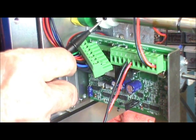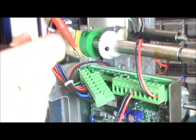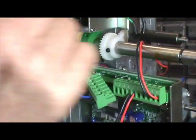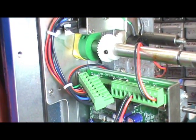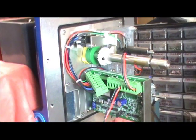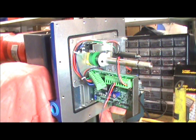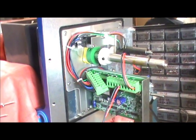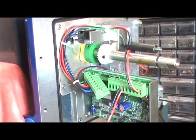When you did it, you loosen that and while you had your probes on pins 1 and 2 you rotated this so that the feedback potentiometer would change and get within 500 ohms. That makes me wonder why the mid-position is off. You told me that the full open is off, so we're going to run it to the 20 milliamp position and take a look at that to see if we can calibrate and bring that mid-position in a little bit better.